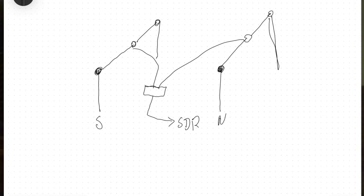A dual dipole, as you would surmise, is two dipole antennas set up in what's called an antenna array. With Radio Jove, the antennas are set up east and west — you have a south antenna and a north antenna. The feed line comes out of the balun in the center to a power combiner or a splitter, and then those signals are combined to a single line that goes over to your software-defined radio.